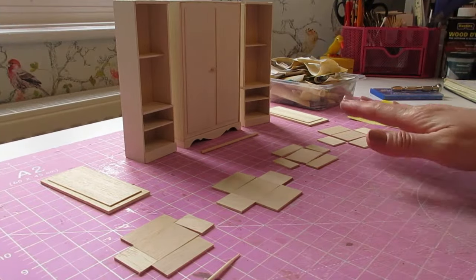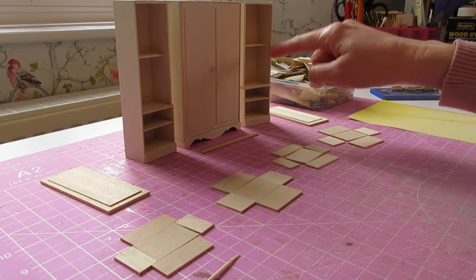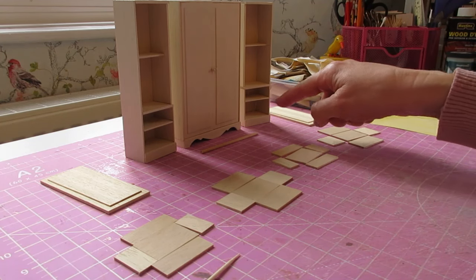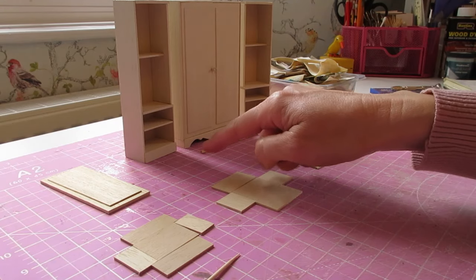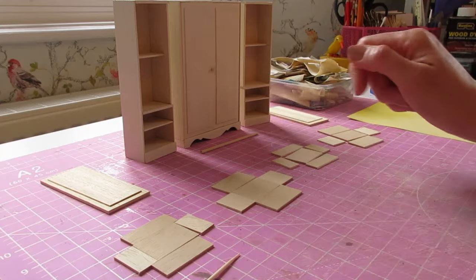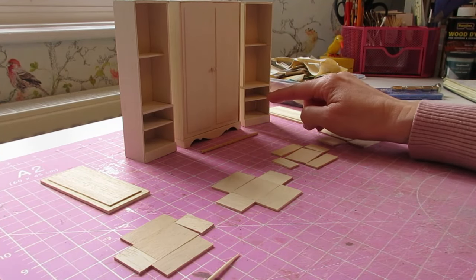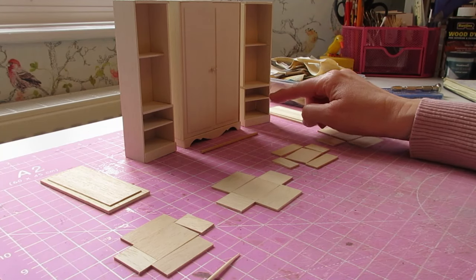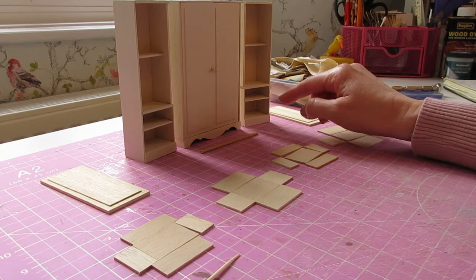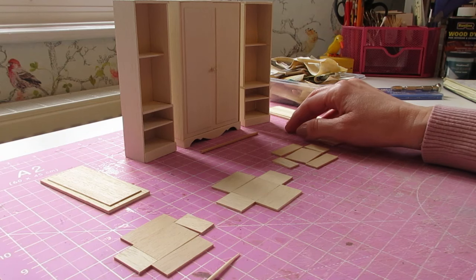You can now go ahead and cut the pieces needed for the doors and drawers. Remember to measure each opening separately — don't just assume that the drawers on one side will be the same as on the other. With mine I've got about a half a millimeter difference between the top drawers. When measuring for your drawers, measure height, width, and depth, then deduct that half a millimeter from each of those measurements.